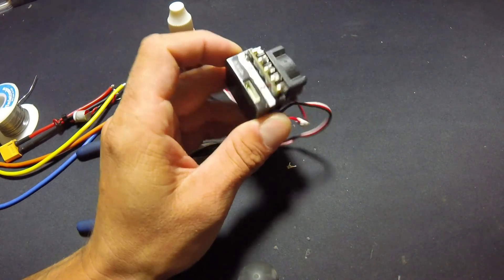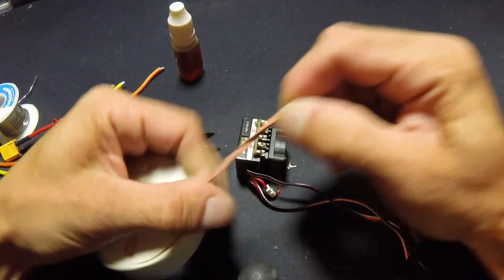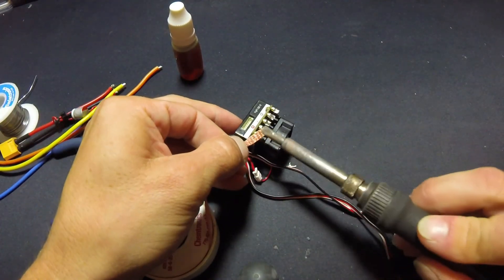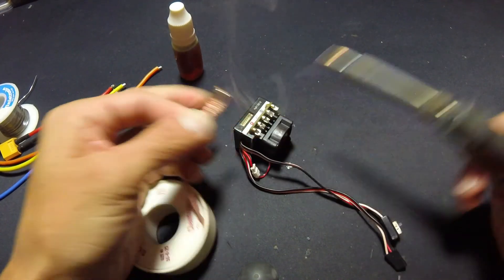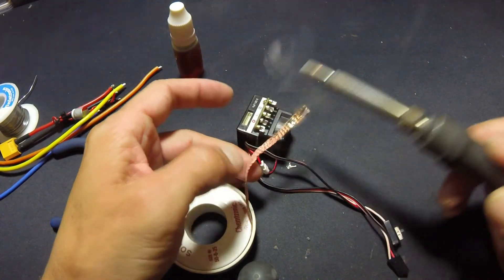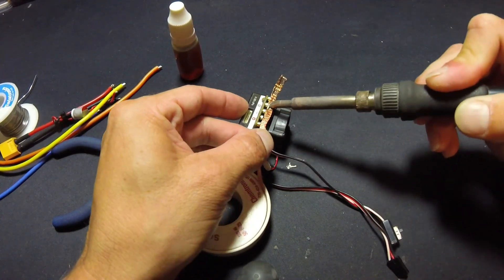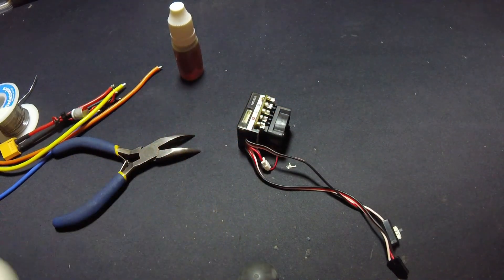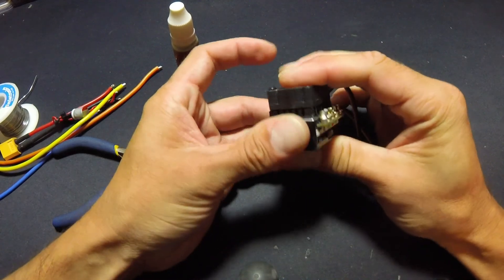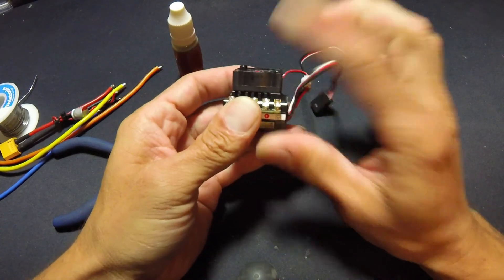The other thing you can do is use a material called solder wick. It's a copper braided material — you just put that on top of whatever you need to remove solder from and it pulls a bunch of it out. Solder wick is wonderful old-school repair stuff. You can get solder suckers as well — plastic or sometimes even an electronic soldering station that heats up and pulls the solder out. Once I get most of the solder out, I'm good to go.